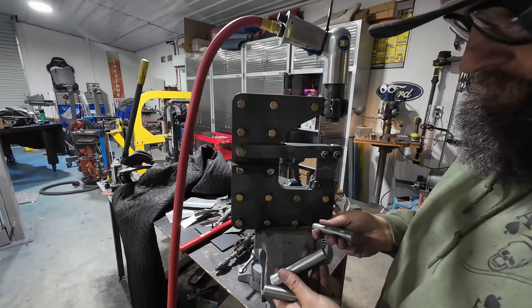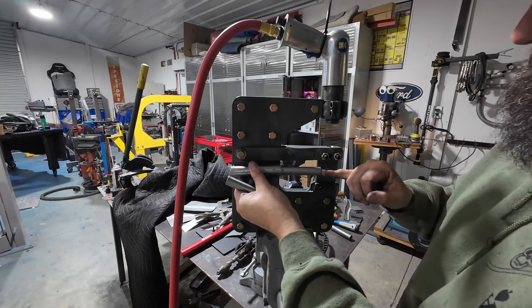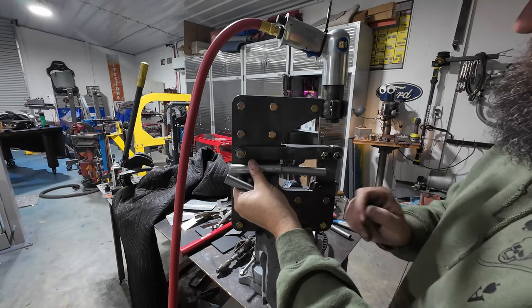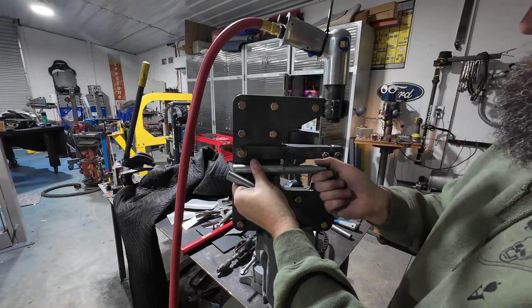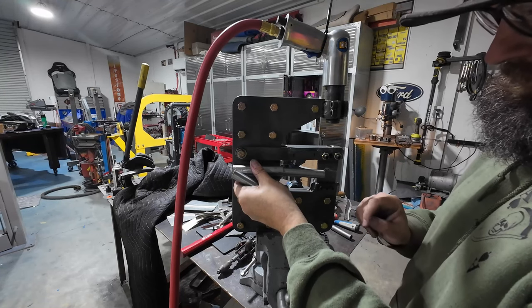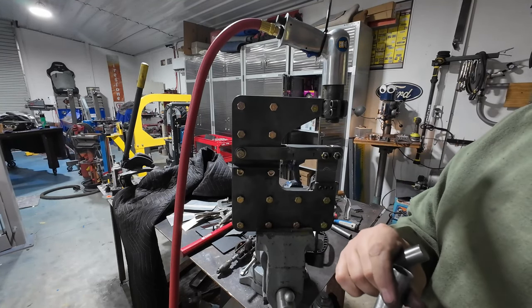Here's my thought: I'm going to weld these here. This reaches all the way out here so I want to put the fence on the tip of this. This right here has probably got enough purchase and I could do a set screw in there. It's kind of sloppy — maybe I'll shim it up. But the idea is if I drill and tap here I can use a piece of angle and put the fence on that way. I think I'm going to drill and tap the ends of these for quarter-20.